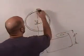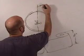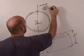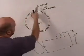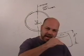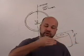So now you're going to set a razor, and not a box cutter, okay? And he goes on to tell you, he says, because it gives you too much leverage. So you're going to set a razor right in there, you're going to cut it. And I'm going to guess, Tim, that that's because that gives you a nice, clean line right along that scribe line, which is the same line you're going to use for your next cut.